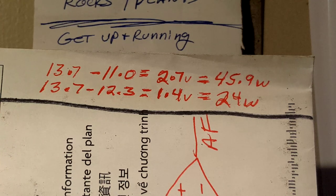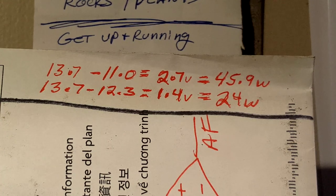If the power supply dropped to 13.7 volts at those clamps and I saw 11 volts at this end of the power cable, it dropped 2.7 volts. With 17 amps flowing, that's roughly 46 watts of heating going on along that power cable, with the vast majority happening in that fuse holder. Now say the voltage at the Molex connector drops to 12.3 volts from 13.7 — that's a 1.4-volt drop. Guys, that's still 24 watts being dissipated along that power cable including the fuse holders. If you're operating portable with a battery, that's wasted energy.